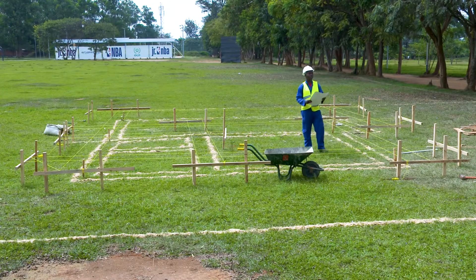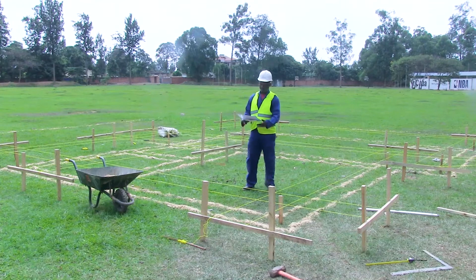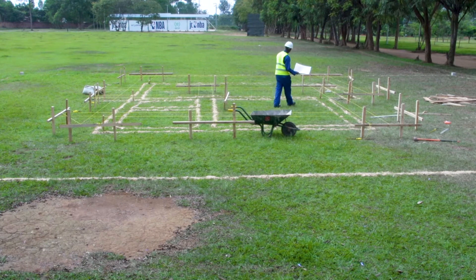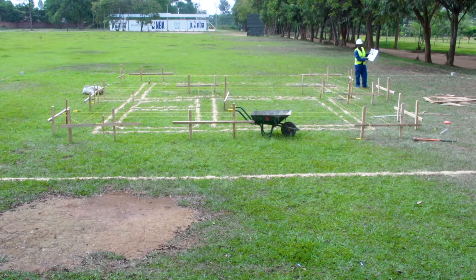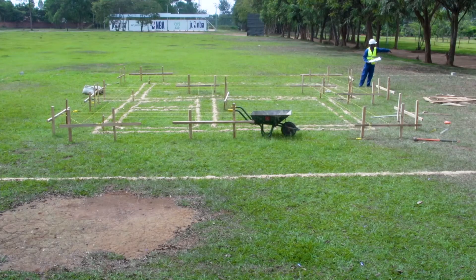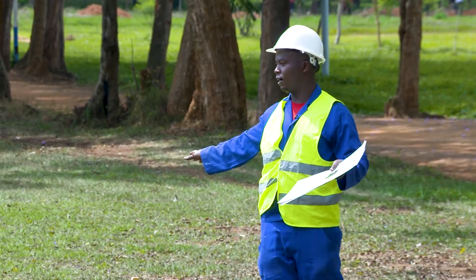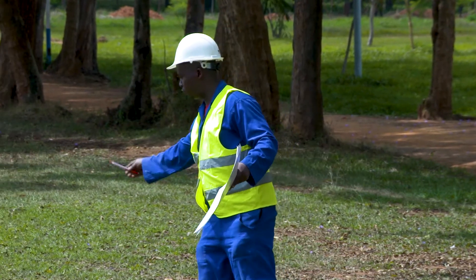Yes, now we come up to mark where our foundation will be placed. Now if we consider this architectural drawing, let's start by showing the entrance. This is the location of our house. We have moved from our plot boundary — we moved 70 meters as you see on the side. So from the plot boundary up to this baseline where we start our building, it is 70 meters. If we check on the side, from this side of the plot the setback is, as you check on your setback plan, 3 meters 30 cm.